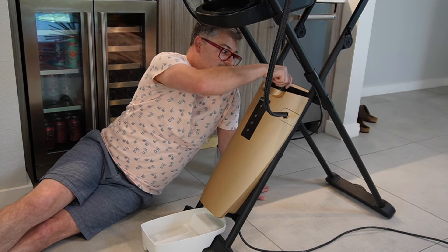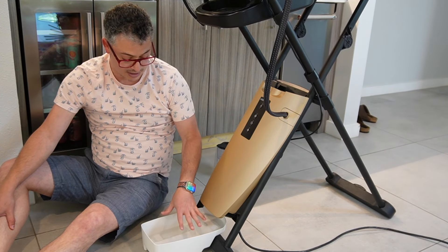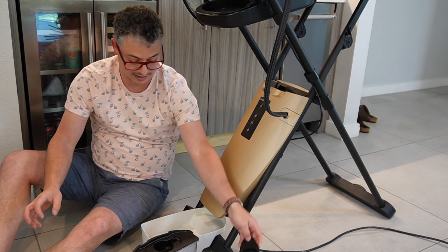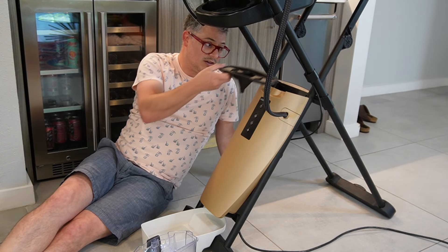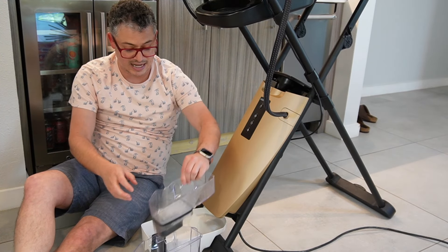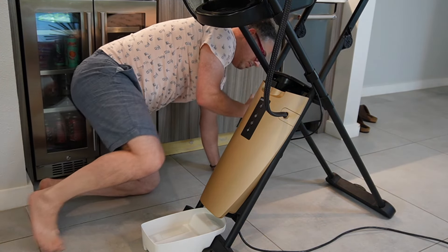So now I'm going to take this all the way out. There's my top screw — one's big and one's small — and I have my bucket with my water in it. I'm going to dump this really quick; there's a sink behind me. We have our water tank, and I'm going to take the lid — the little black lid — off the very top of the water tank. You have this funnel, and it sits right here with the tip of the funnel in the hole that the screw was filling. I'm going to take the filter piece out since I don't need to filter this water. I'll fill this up to my max fill line, set it back here, and it's going to flush our system.